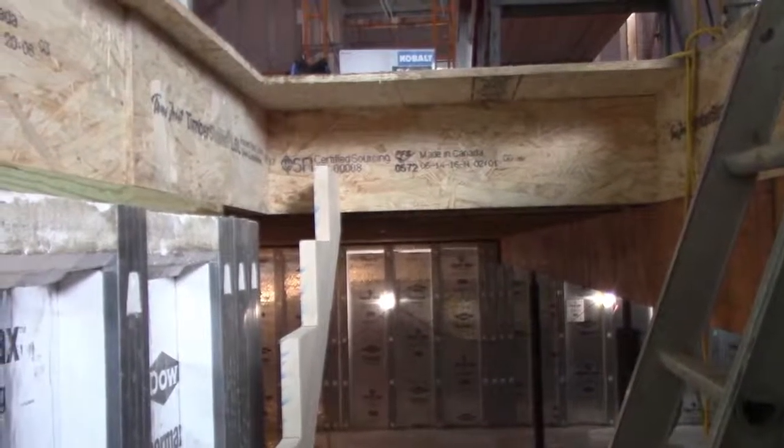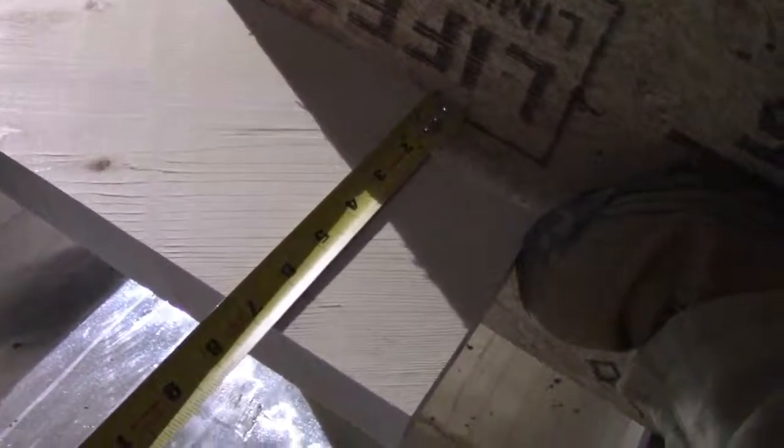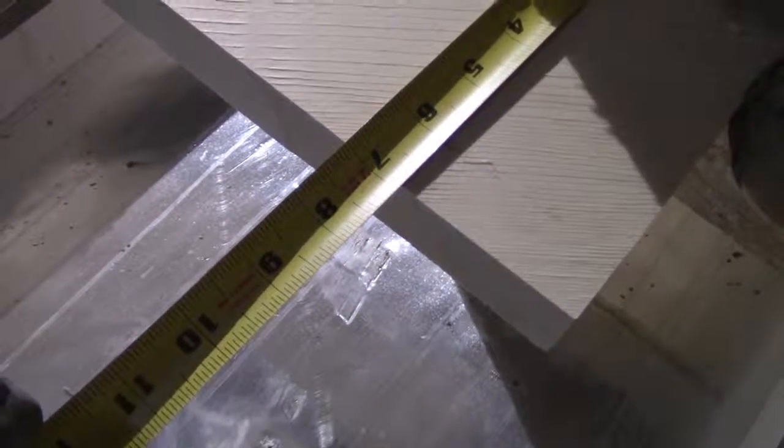I don't know if that's actually where I'll go up there or not, but if it is, then this is pretty close down here. We're right at the edge of the subfloor, which is what we were hoping for, edge of the platform, and we got our notch for our kicker. And I should measure height on this. So this should be 7 inches, and I know you're kind of upside down here, but we are right at 7, which is fantastic. So we can keep going with the other two stringers.